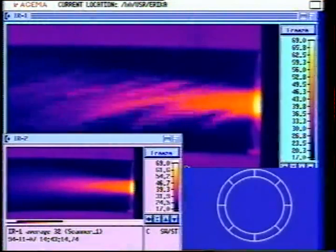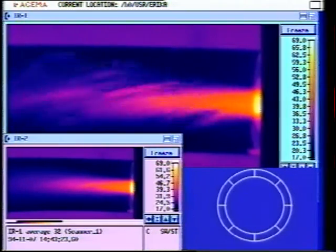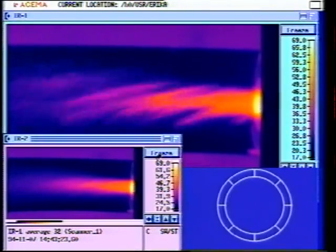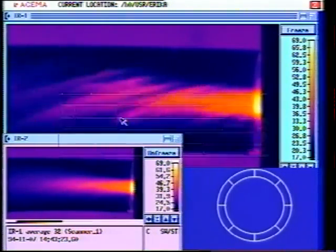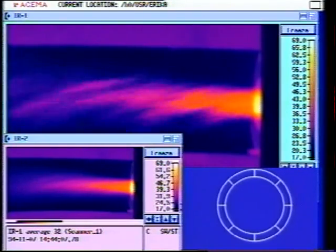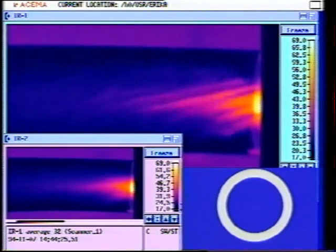It's Monday, November 7th. This is a reference case for a 30 meter per second axisymmetric round jet with no excitation. Our plenum temperature is 204.2 degrees C. Run 47, mode zero, which means all eight exciters are on in phase, surrounding the round nozzle. Amplitude 115 millivolts, velocity is 33 meters per second, temperature 204 degrees C.